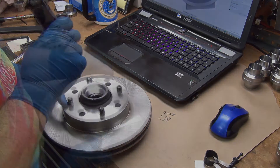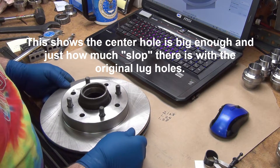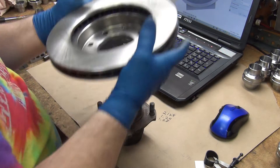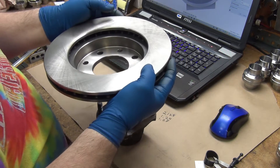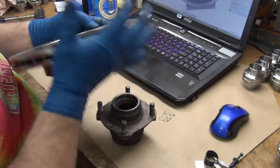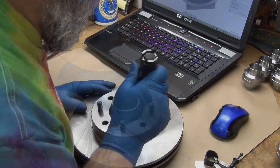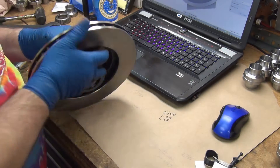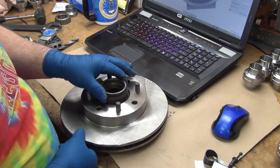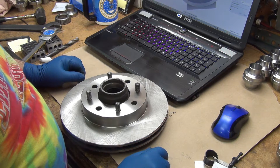These holes aren't quite right, and that's why I wanted to drill closer to the correct size. I drilled them out on the drill press to the next size bigger because of the way I have it in there — the registration pin isn't tight so I can't put it back in there accurately. I just re-drilled them since that's the only thing that's off. I might need a bigger chamfer in the center to make sure it's not held up. I can get it tighter with the sleeves, but I think I need to rewrite it a little bit.